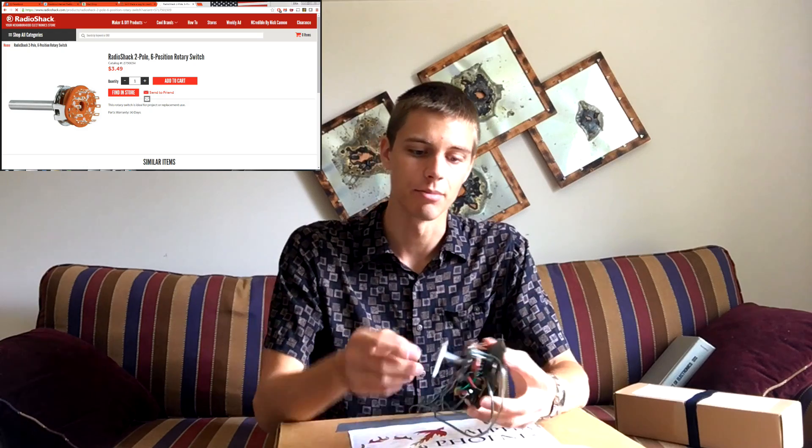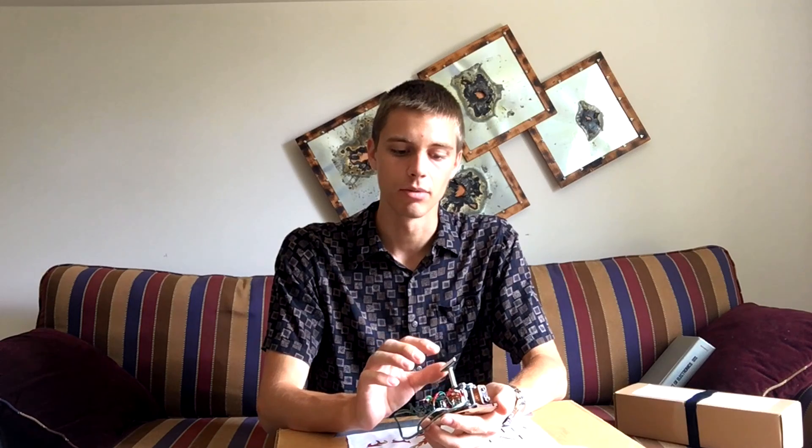The main switch on this board used to be a double-pole six-throw rotary switch, but it didn't turn all the way around. I wanted to be able to point at each player as it goes all the way around the board, so I bent up the tab that stops it, removed one of the brushes, and turned it into a single-pole 12-throw switch. Now it can point anywhere all the way around the board — 12 different positions for six players.